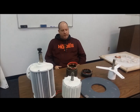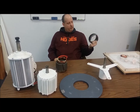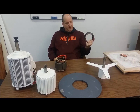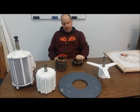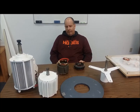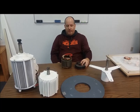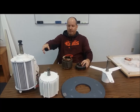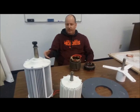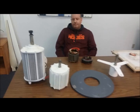Going back to power production — in our last video we showed a couple of blades, and I just want to talk a little about the alternators and the blades and how the blade sets work. We've got a few stators on the table. This is an original Delco 12SI that's been rewound for wind. Here is the stator from the White Lightning in comparison — and this is the big 2kW alternator and blade set that we showed.